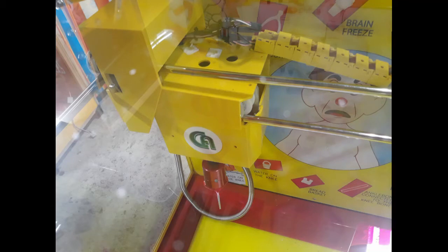Now, it's time to get this claw moving. I actually got extremely lucky and didn't even realize it. Out of all the boards that were taken out of the back, luckily, they left the motor driver board. So, after a little bit of trial and error, I discovered I just have to ground certain pins out to make it move in different directions. So, with the Arduino and a couple relays, it's pretty simple, and I got the claw moving.